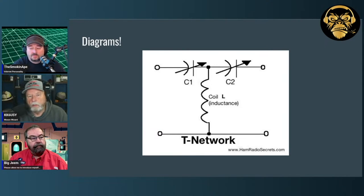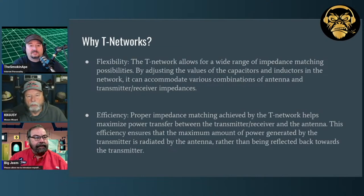What we have in these tuners are called tapped inductors — not roller inductors — but they are variable. That is not the schematic symbol for a variable inductor, which is why the question came up: wouldn't that be a variable? We just looked at that schematic symbology, so it's a fair point.